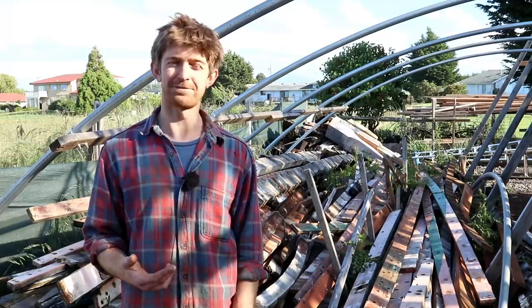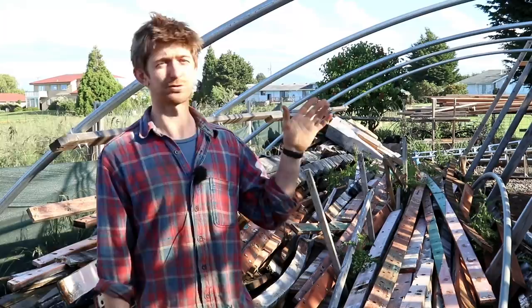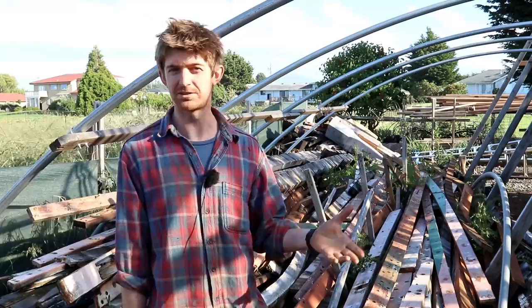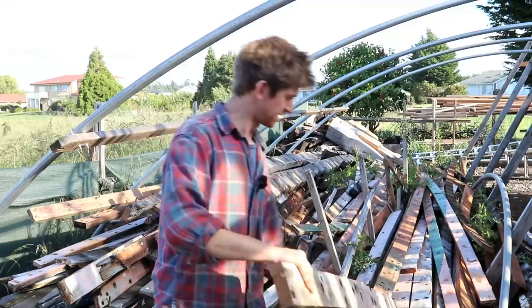So I'm thinking of varnishing the transom instead of painting it. If I do that though, I'm going to have to repair it very carefully, and also all the repairs are going to have to be the same timber, so it looks good. But luckily, with all the planks that we took off, I've got an almost endless supply of small pieces of teak here. I'm hoping to reuse a lot of this stuff in the interior, but in the meantime I can use it for fastenings, for graving pieces, for bits of the hatches and so on, anywhere where I need a relatively small piece. So here's a piece of planking. And as you can see, there's a lot of fastening holes in it, but these bits in between should clean up pretty nicely.